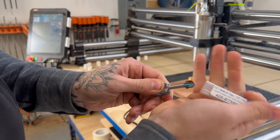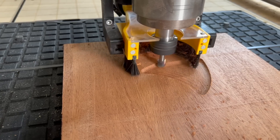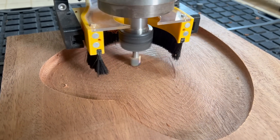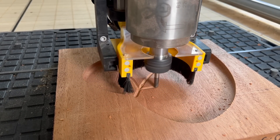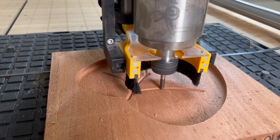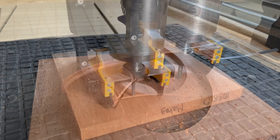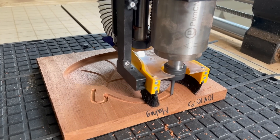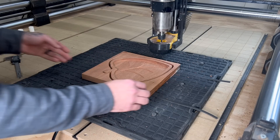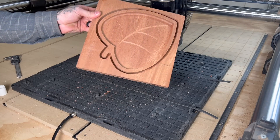We need to make some catch-all trays, so we're going to use Bits and Bits' new spiral bowl bits. If you want to support a small business, check them out — I'll have a discount code link in the description. This was my second carve on the vacuum bed, now knowing I can't cut all the way through without being conscious of it. I designed a quick catch-all tray with a V-bit design in the bottom. I was probably a little overly cautious — the piece was about 0.87 inches thick and I cut down to about 0.81, but it was still easy to poke through with a sharp countersink bit.